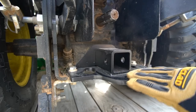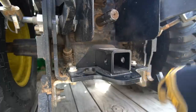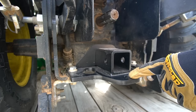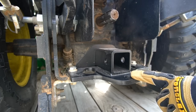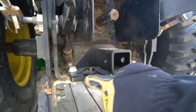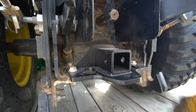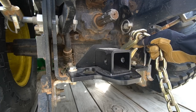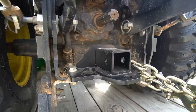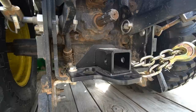Here's a great look at the rear plate for a John Deere 1025R. You've got the integrated tie-down points, your two-inch receiver, and even a pinhole for garden carts. It's a great multi-purpose all-around product. You simply take the flat existing plate out, reuse the same hardware, and bolt this on in its place. You just fish this right through — no welds, CNC machined, uses existing hardware, multi-purpose, and DOT compliant.